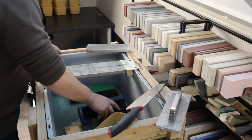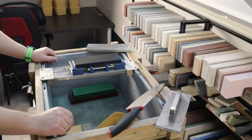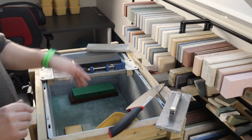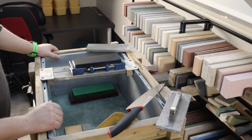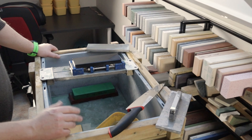The next stone I wanted to compare is the finish slate. It's sold as a 1000 grit, but it isn't — not really. Natural stones don't have abrasive particles in the way that a man-made stone has; they have natural mineral inclusions that differ from stone to stone. That's part of the charm. From reputable quarries, like Ardennes in Belgium, you'll have a good idea of what to get. But they don't have strict grit ratings — manufacturers give you a range, like 800 to 1000, or 8000 to 10000.